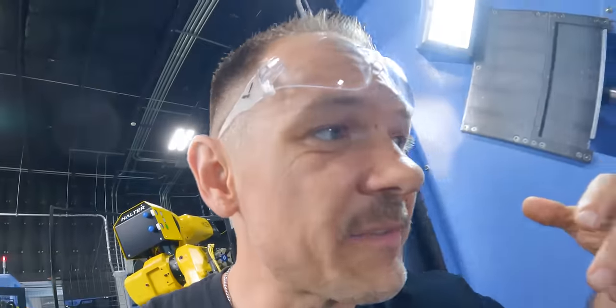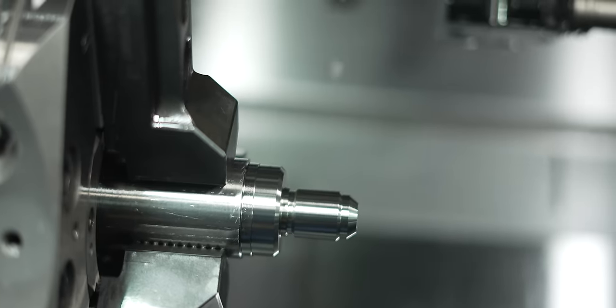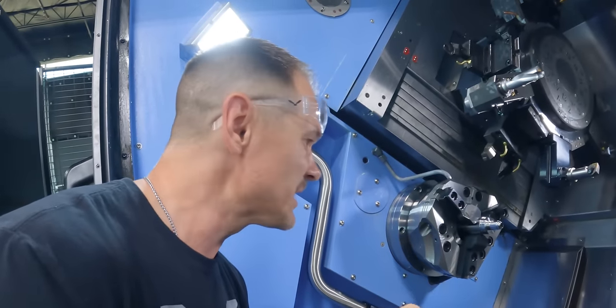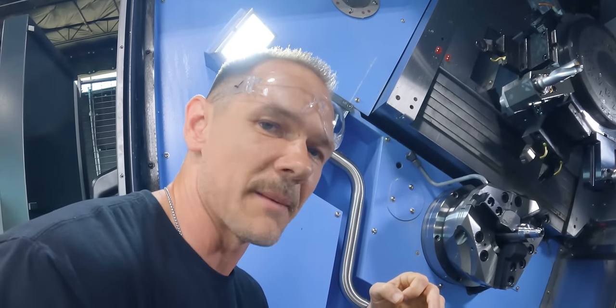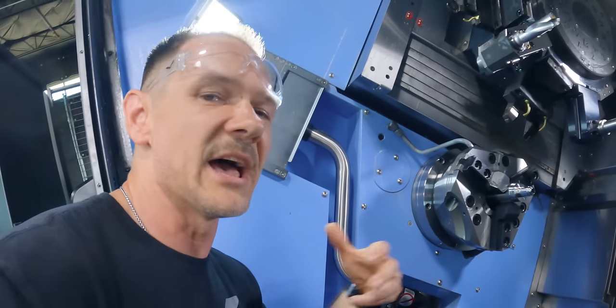Okay, all right, so we have finished the outside of the part. You can see right here. Now, one thing I wanna mention about Haynes 188 is it does work harden rapidly. That means when I'm coming across with my roughing insert, right beneath the layer where I'm dragging across the metal, it is hardening that material and making it very difficult to come back across. So when I do my finish pass, I wanna take a relatively healthy depth of cut.